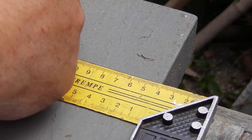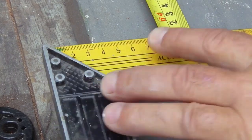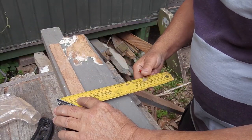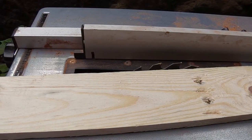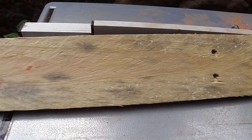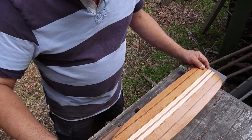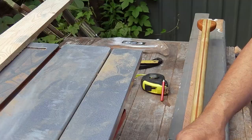So which timber do you need to use? I'm using an old handrail which is Oregon - it's probably got nail marks and dents but that doesn't matter too much. I'm using Oregon because it's lightweight, and then I'm going to use Merbau which is an Australian hardwood for the thinner contrasting dark strips. Then I've gone to Bunnings and got some old pallet material they were throwing away - rough sawn pine - to use as the lighter colour wood to contrast against the dark. Because I'm not paddling hundreds of kilometres with this paddle it doesn't have to be super light, so it's recycled building timber - a bit rough and ready but it looks all right.